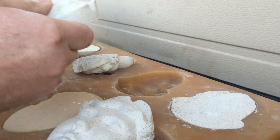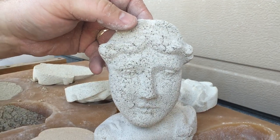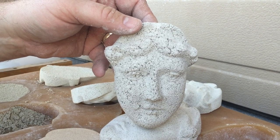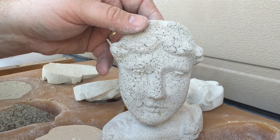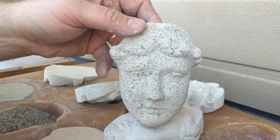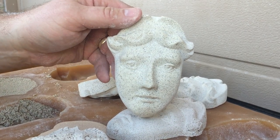Going too dry could also be an issue. If you look at a piece that's too dry and you don't do the tamping procedure, you can see the bug holes look a little bit different. This is what happens when you don't tamp down the material very well. That tamping process really gives you great compaction and a nice clean finish, as you see in this face here.